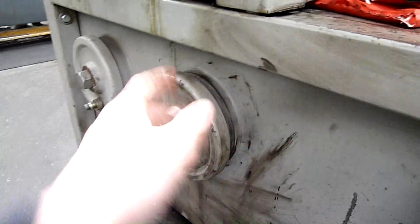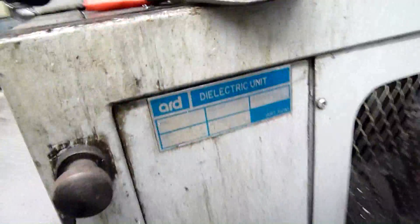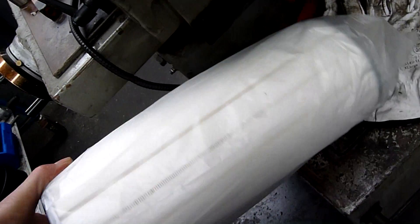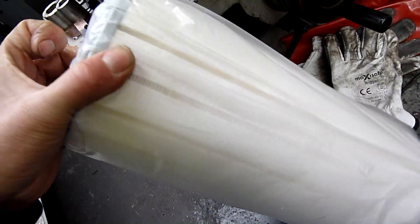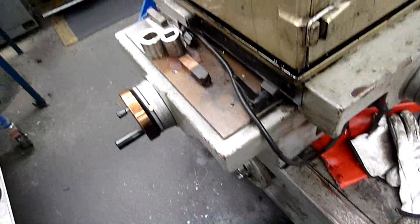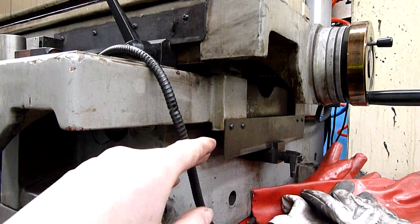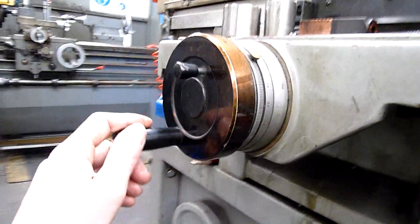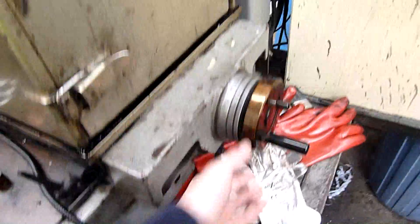The dielectric unit has two filters and a three-phase pump. Dielectric simply means insulator — insulating oil. That's an example of one of the filters — that's a new one. We go through one every 20 parts or so. They're only 50 to 60 dollars each, so the value for money is really good — just like a giant oil filter for a car. The table has full X and Y axis control and a digital readout. The spindle doesn't have a DRO scale on it, but you don't really need it — it's got the micrometer to set your depth. These are set to freewheel, or you can lock them in and adjust. At least this way if someone bumps it, it just freewheels.